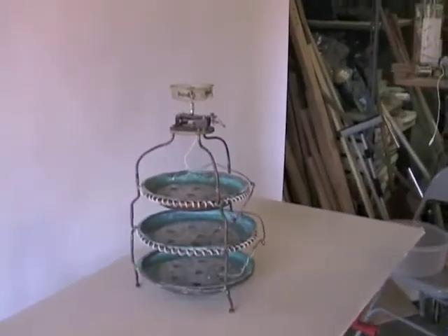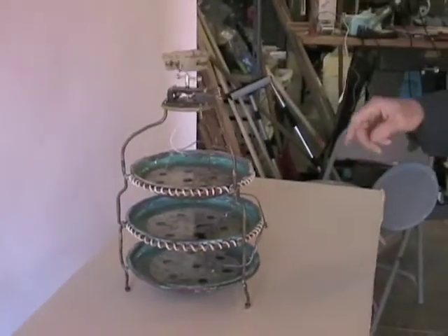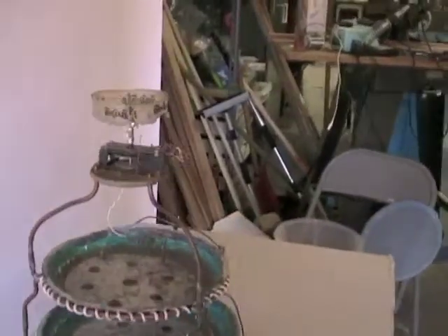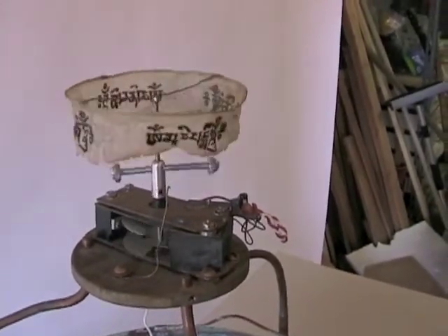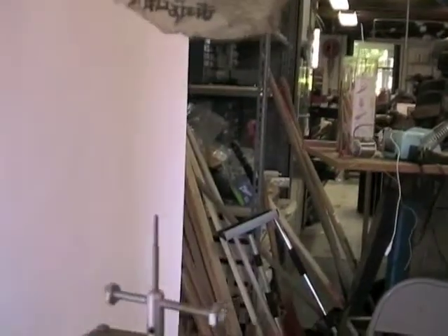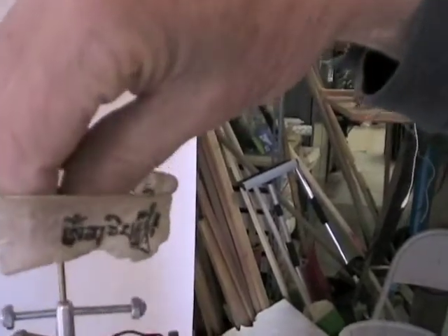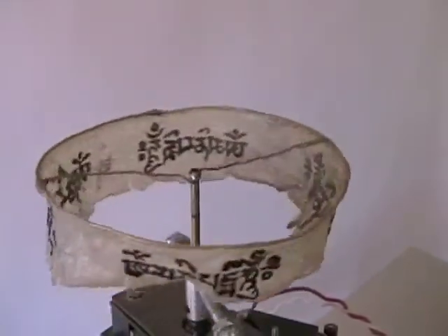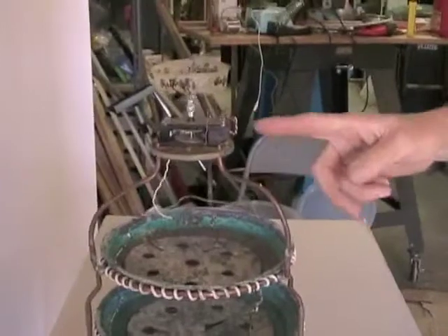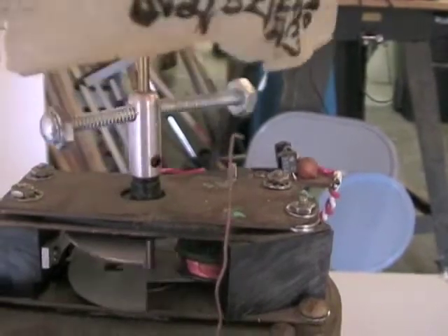It's working now. It's from 2002 and it's got a little mechanism that's from an inexpensive clock that's been remade into brass. It oscillates back and forth and on the top is this little prayer wheel thing. It's got Om Mani Padme Hum written — a Nepali Buddhist prayer. It's important that these prayers go in a clockwise direction. The key part of getting it from just oscillating to actually moving around is this little spring. When the little arm hits that spring, it quickly stops the rotation and the momentum keeps the wheel going even though the oscillator reverses.